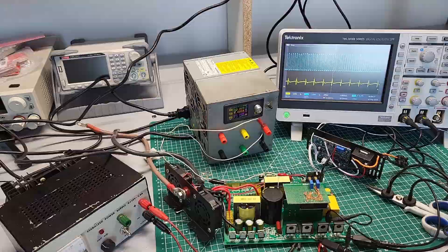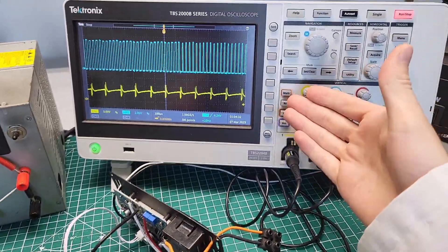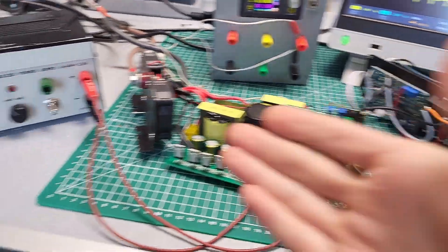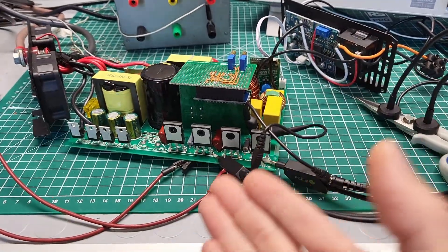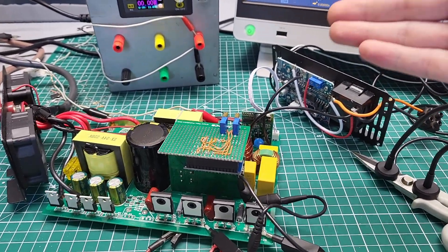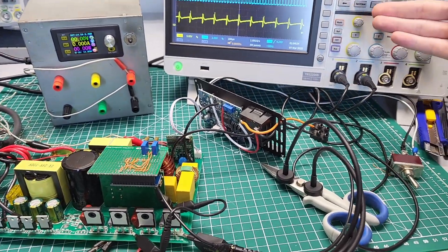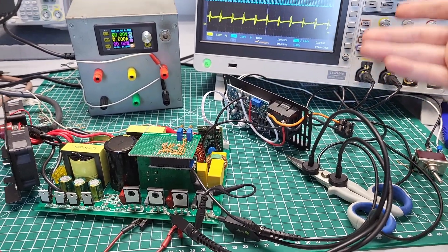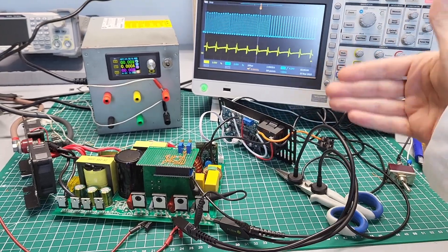Three hours later — and again, no way! Another gate driver shorted. Again and again and again. I was testing it with the bench power supply, only feeding the full bridge with 24 volts — not even 400 volts from the DC link — and it shorted again. From what I've seen online, the only real fix people have found is to throw away the entire control board and install a new one. At this point I really don't know what to do with this inverter.